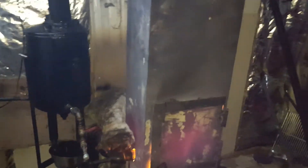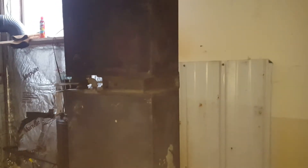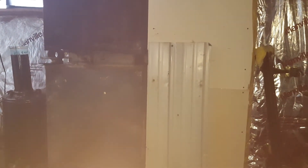That's why coal at night is something I'm looking into. I'm going to put an 8-inch stove pipe heading outside behind the stove and I'll have a coal bin out there that I can open and let the stove fill full of coal. I buy this two-inch-and-smaller coal. The coal will feed in there, I'll make some grates, and it'll hopefully burn well. Flash turned off — good deal. Key with coal is of course some air — just like anything, throw some oxygen at it. My pipe in there right now is blowing down into my oil chamber, my burn chamber. I can turn that 180 degrees up so that air is blowing straight up through my oil burner. So if the top half above that door was filled with coal with the air blowing up through there, I think it'll burn well.